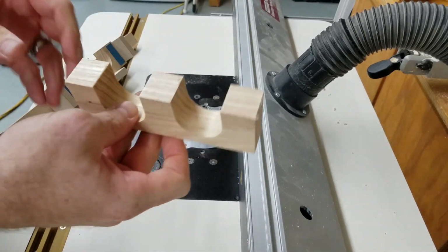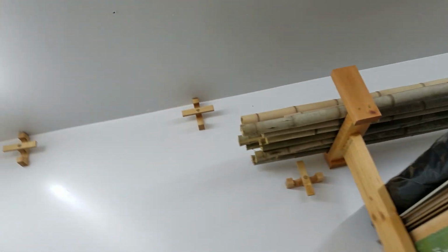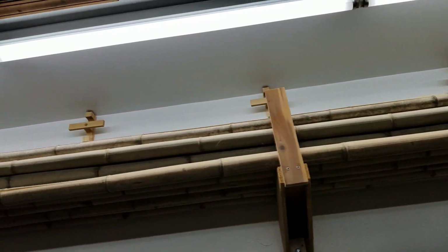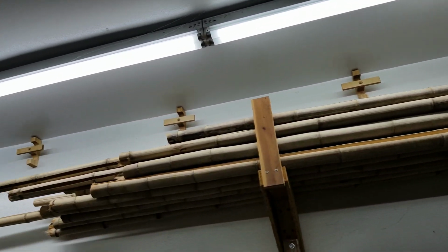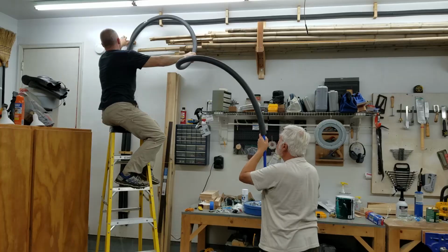Now that sounds expensive, but when you think about the fact that I was getting estimates from plumbers that were around $1,500, that $135 on sale expense of the router bit was a very worthwhile investment. I finished all of the brackets by wiping on a single coat of polyurethane, and then before cutting all the existing pipes out, I screwed the brackets onto the wall. That way everything was set up for installation.